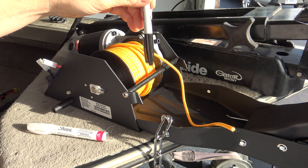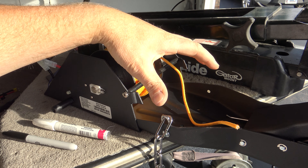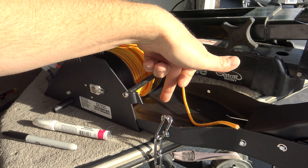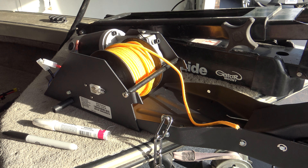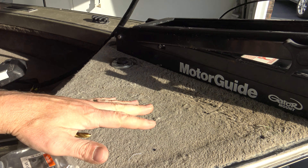Get all your locations marked and then move the unit out of the way, and drill all the holes in those locations. If you're going to drill in another location, wait until you get this bolted back on and then drill right through the metal and your boat at the same time when you put on those bolts. When you drill these holes, start out with a small drill bit — maybe like a 3/16" drill bit — to drill all the pilot holes first.